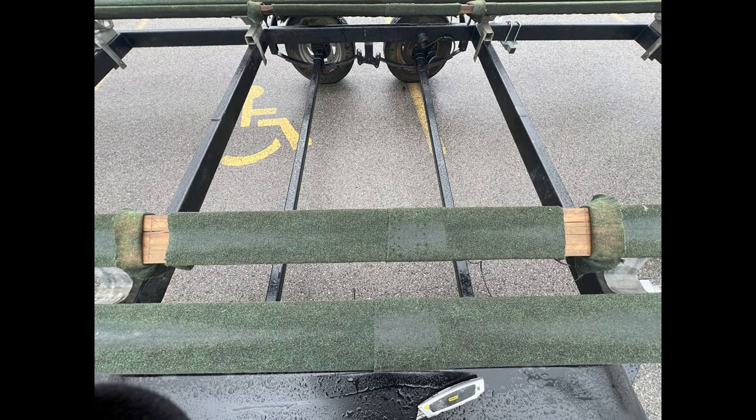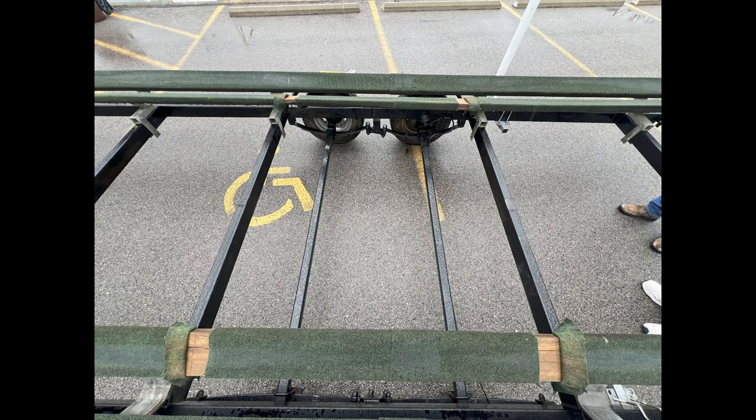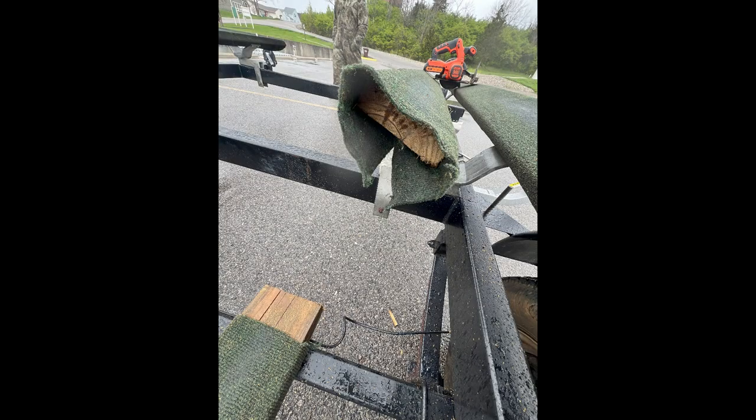Here's an upward view of what we're talking about. The maximum exposure of the wood is where we're going to be cutting — not the minimum — so we cut it out as wide as we can. This is another view of where we're cutting; you can see the other side in one shot. Keep in mind you can cut rubber, plastic, or any kind of covering you have on your two-by-sixes, two-by-fours, or two-by-eights. You peel back the material so you have excess, cut up to that, and then fold it down.